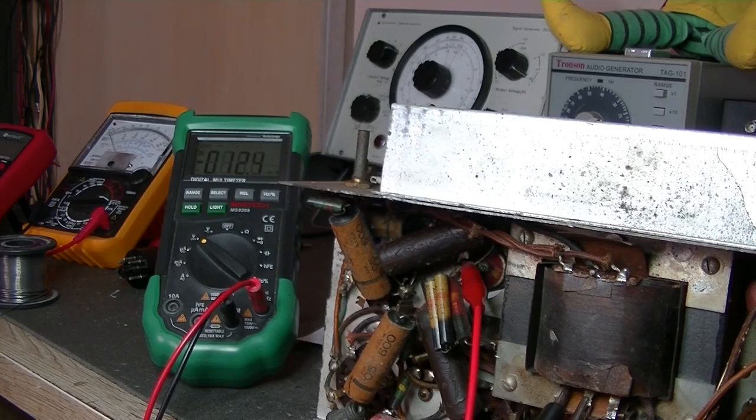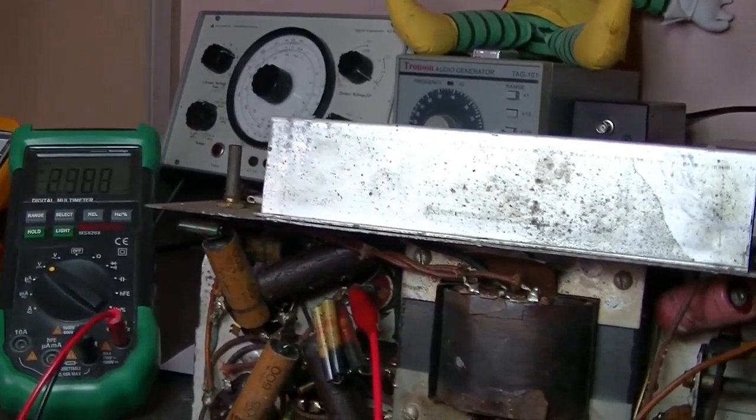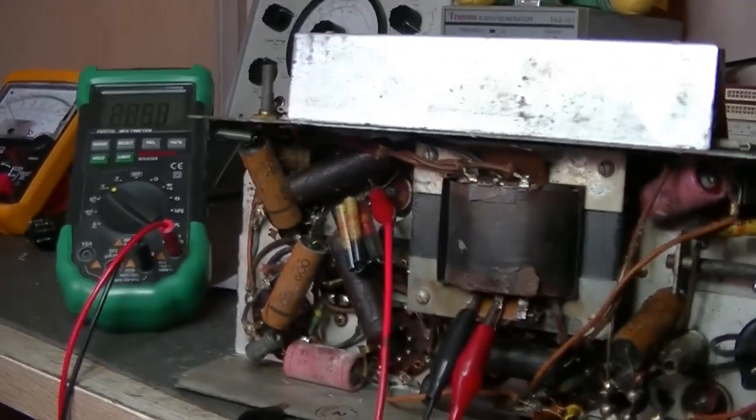That's 100 volts - a bit more needed to kick in. Come on... 140, 150... and now I've got a short - the current limit is lighting up. I'm at 160 volts and so far we've got 4 to 5 volts of DC - that's certainly not enough. I'll show you the current limiter there - they're glowing nicely. Turn the power off.